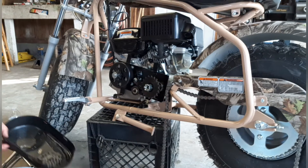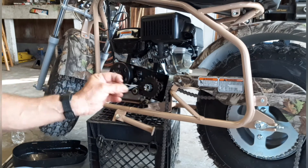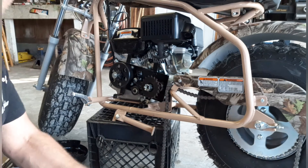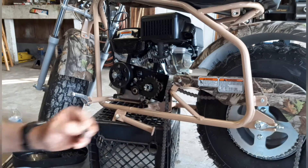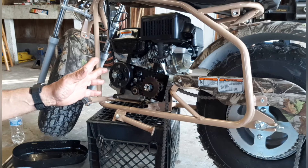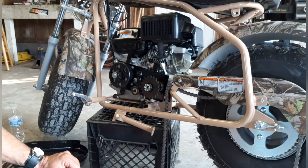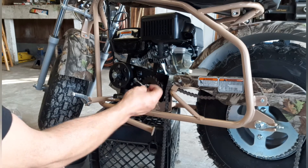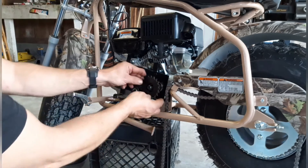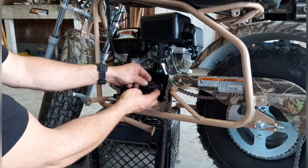Basically there's a cover and there's four pins — these little pins go in these four spots and the cover comes off. The chain has a master link like a bicycle. You take the master link off and you remove the chain, and remove the rear chain. There's a small chain for the front and a larger one for the rear. What I found was this part here was seized up and grinding. There was a cotter pin inside this shaft and a 15/16ths sized nut, and then I was able to slide this gear off. I lay everything straight down so I know the exact order to put it back on.